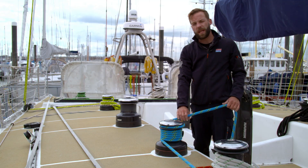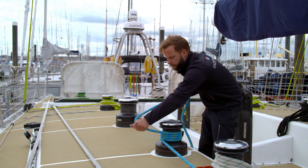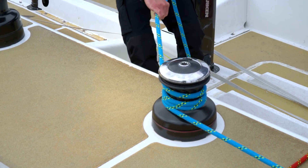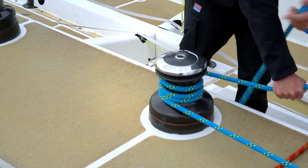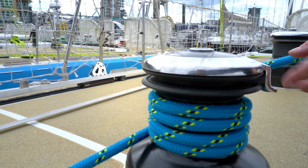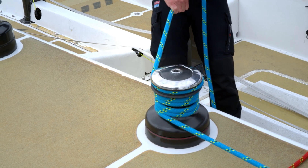At no point there did I let my hand come in between the rope and the winch. So I'm just going to demonstrate that again. You've got your three turns on the drum, pull in a little bit on the line, and then keeping a constant straight radius pull away from the centre of the winch. It comes across the silver pre-feeder, winch stripper, into the self-tailer at the top.